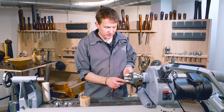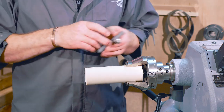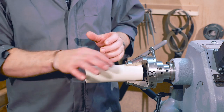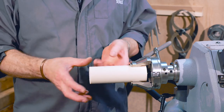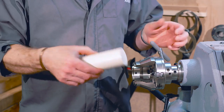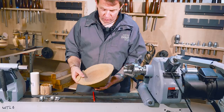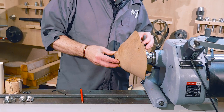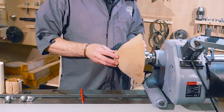We've changed the jaws to different steps — this is the 50mm O'Donnells, so that's 50mm internal. If you're doing something with polyester resin, these can be really good because they give you a way of actually holding a long way down, physically gripping it. Obviously the 25mm ones will do the smaller size, the 50mm fits straight in here. The advantage with this: if you mount polyester resin between centres it's very brittle and the centres can actually crack or break it. But going this way, we can mount it quickly, turn something as a spigot to hold it, cut to length, turn whatever shape you want. Also, for a rough-turned bowl, I tend to try and leave a spigot inside — it gives me a way of putting it on here and gripping down onto that spigot. It allows you to remount it to turn the outside shape, and by having that extended length it allows us to grip right down inside the bowl really nicely.